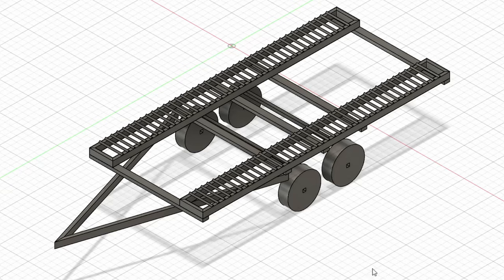I've made a few designs of trailers. This is the first design. As you can see it's an over-wheel design which keeps the trailer as narrow as possible, so that the car sits over the top of the axles and wheels. This made it so that the ramp would be very steep for getting the car onto the back, and also any vehicle sitting on the back will be sitting very high, making the center of gravity very, very high.